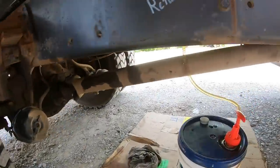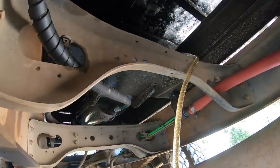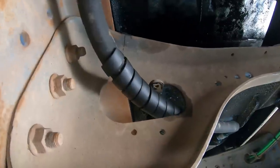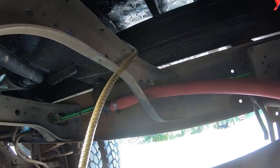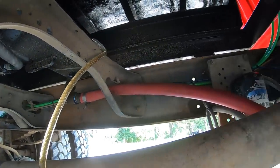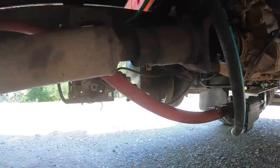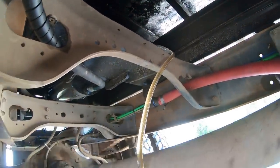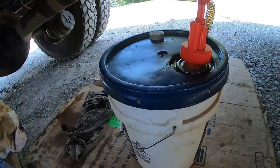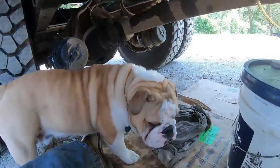Oh yeah, I hope you can hear right now, the neighbor's cutting her grass, but I put some new hydraulic lines on because the old ones weren't long enough. Put some abrasion wrap in spots where the lines are going to contact the truck bed. I still got to put one over there where it passes through the cross member on the return line. But there's a new pump all hooked up and everything. Now I can't raise the bed until I got fluid in it, so I'm going to use a ye old bucket pump. Get the hydraulic oil up there to where she needs to be. And then ride meatball.